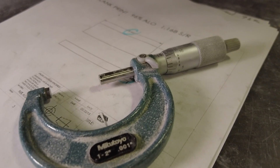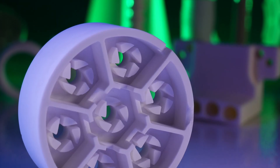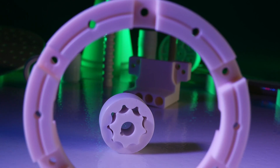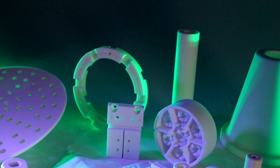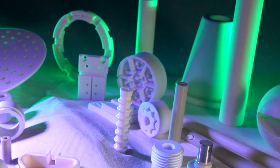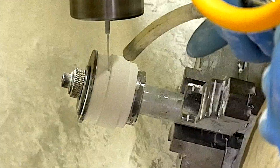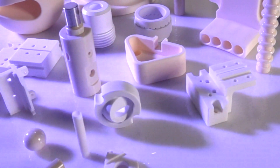What International Ceramics does that is so different from almost all other ceramic manufacturers is we encourage prototyping. We're not worried about one piece, three piece, or five piece orders. We're here to help you with material selection, design, ideas, and a manufacturable component in the end. We want to get your project off the ground. And it's an actual part — not a 3D printed part. The part has been pressed from powder, green machined, sintered, and post-fire ground to your tolerances.